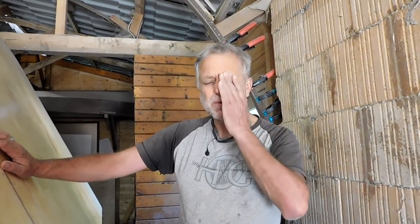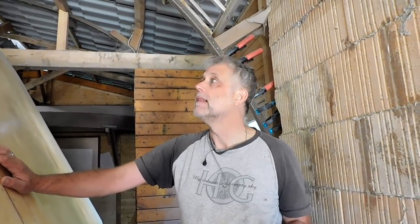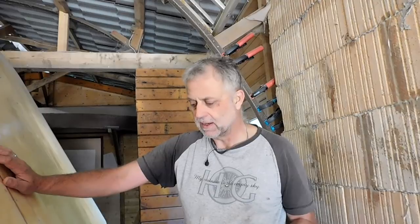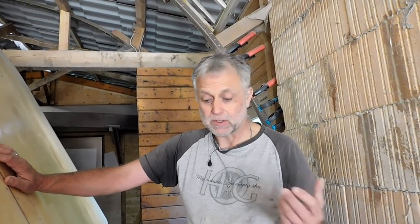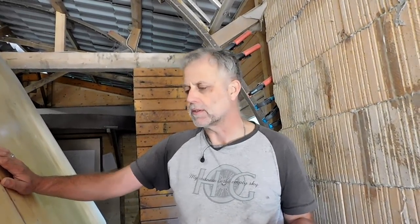So if you're thickening epoxy, you've got various options. The one that I use mostly is microfibers. That's good for gluing and hard, strong filling. Another option you've got is chop fibres, which are about 6mm long fibres you can mix in. It's what the Canadians used to call bear poop when you mixed it in with epoxy for filling big areas. I didn't say poop.